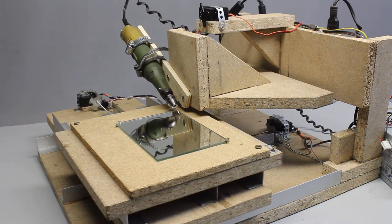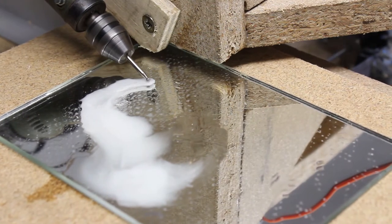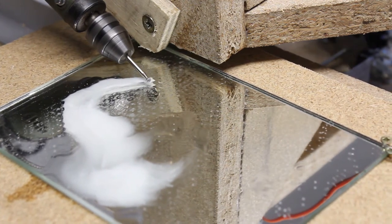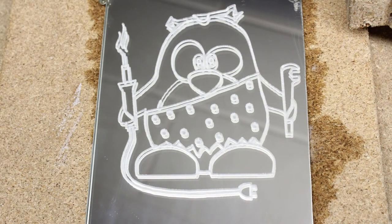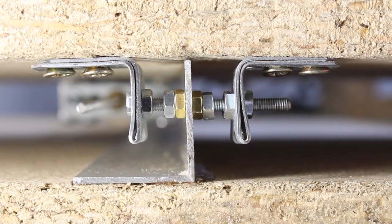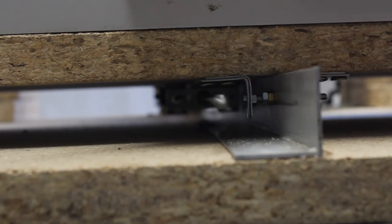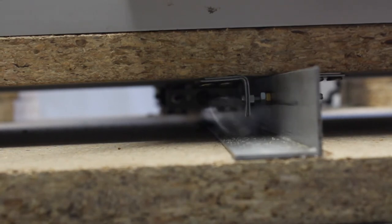Next, glass is engraved, so a router has to be mounted on the vertical axis. The diamond milling cutter has to be cooled with some water during engraving work. Even with the modified servos, the CNC machine needs approximately 60 minutes to process the file. The result is really good. In plotting mode there is almost no side load on the ball pen, but the router has to be pulled with higher force over the glass plate during engraving work. Under load, the aluminum bars and iron angles are visibly deformed. The threaded bars are also a source of inaccuracy — the end of the X drive starts vibrating at a certain speed and position.